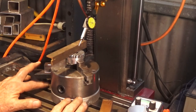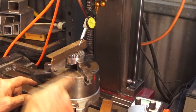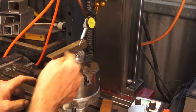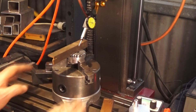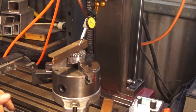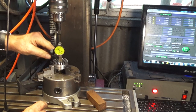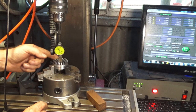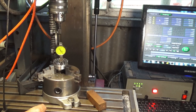I'll finish these off out of the vise. Because of the way I had this set up on the big angle plate in the Bridgeport, I couldn't bolt this chuck down using the two slots parallel to the table slots, because I had to align these cooling fin slots with the Y axis on the mill. So what I've done is just bolted it down with one bolt, then swept the indicator backwards and forwards along a piece of brass stock and tapped it in until I got it accurate. I've got that pretty close. So that's all bolted down now, and what we need to do is find the centre of that part and set that as the origin, then go ahead and do all the drilling and counterboring in the head. I swept an indicator around this section of the head — my probe won't really work here due to burrs on the inside of the bore. I did it the old school way. I think I've got that spot on, so I've zeroed X and Y there.